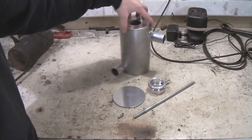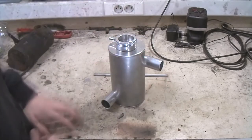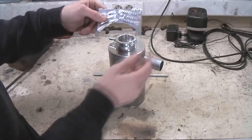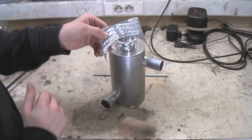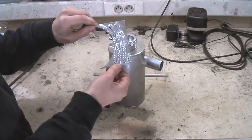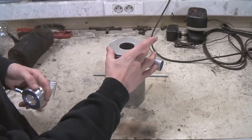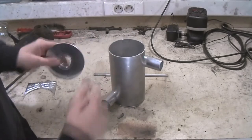So I'll quickly mock everything up. This is the mock up, but I'll have to weld it all up with my TIG machine. I've done some testing on a piece of scrap aluminium - as you can see some are better than others, but you can see the stack of dimes pattern. So this is just some quick practice, but it'll be enough for me to have a go to weld this up. We'll start off by welding the radiator neck to the top plate and weld this from the bottom, because you won't have any access to it otherwise.